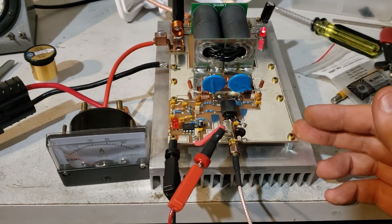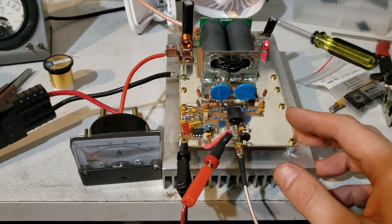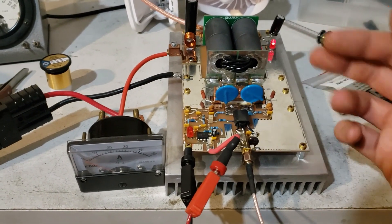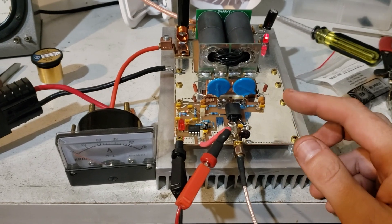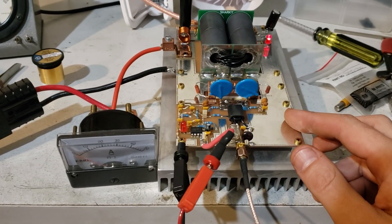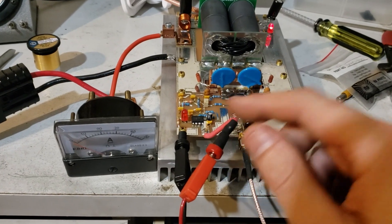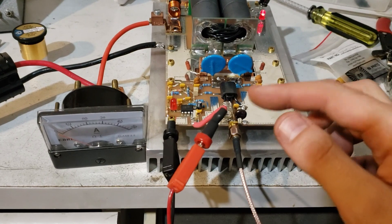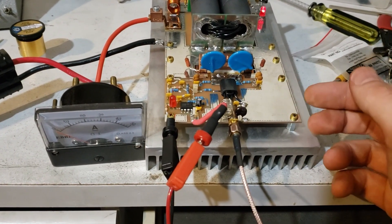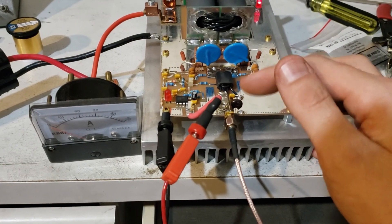When I first built this, I slapped a chip in there and basically I copied the NXP reference pallet as far as the output circuit goes. The input circuit is a little bit different from the NXP reference pallet, mainly in that the whole bias circuit is all through-hole components instead of being surface-mount components. There are some minor changes in the input network just for a better tune.